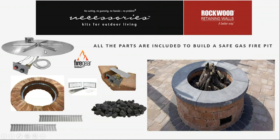Here are the components that come with the kit. On the left is the burner system — a completely assembled system with the spark connector control panel. Brackets come with it to mount in the landscape block, this segmented retaining wall. A lintel is included to support that block, making it easy with no cutting needed to install the controls in the landscape material. The vents are sold as a pair to ventilate the fire pit.